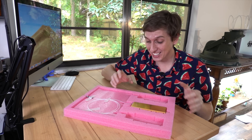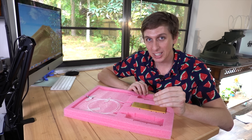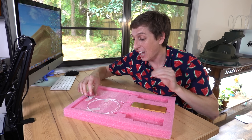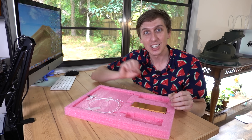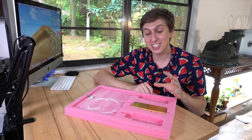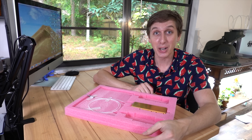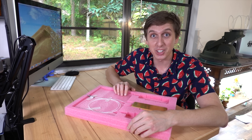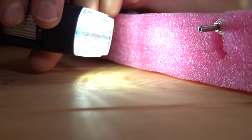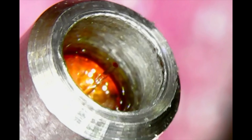A 200-watt laser — that is insane that that much laser power can come out of this little fiber. So this laser is terrifying for two reasons. Number one, all of the energy comes through this little tiny glass fiber. This fiber is only 100 micrometers in diameter — that's like the size of a human hair. Another reason it's terrifying is because the laser is invisible, so as Styropyro would say, this laser could vaporize your retinas without you even knowing it. Here's the end of the fiber laser right here, this little thing. And if we use this little USB microscope, we can actually see the fiber where the laser light comes out of.